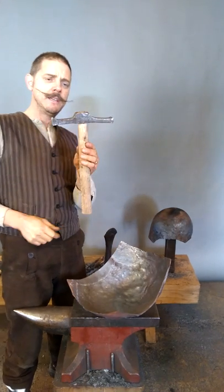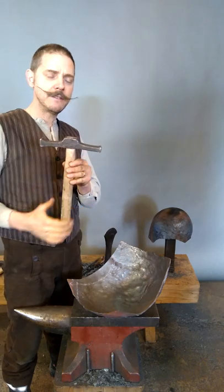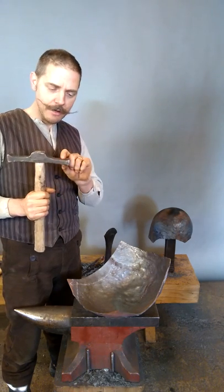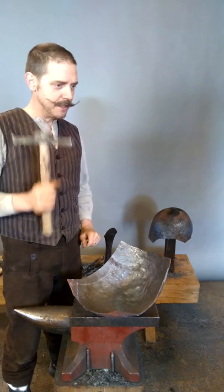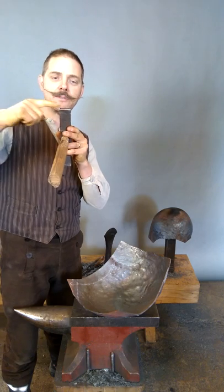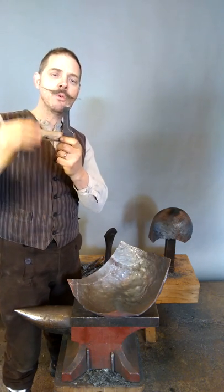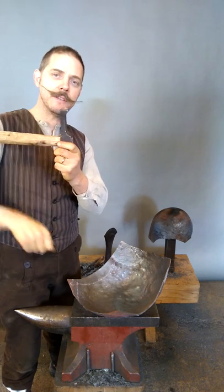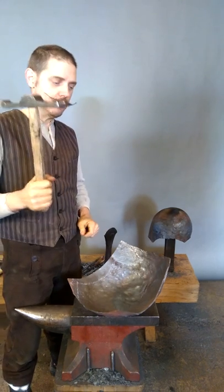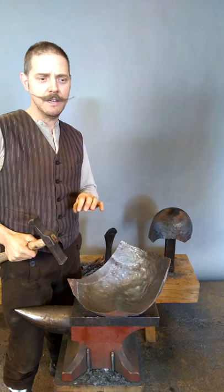The next hammer I've been using is this one, which you can also see in contemporary artwork — a quite common shape. Here you also have two heads. This one is a little bit lighter at 1.2 kilos, also made of 17th century iron with steel heads welded on. I use this in the start when I'm stretching out the material flat, because this head is more straight but more rounded here, so you stretch it more in one direction. I also have a bit more flat surface on this head, so if you have a lot of dents you can even the material out a bit. I use it when stretching flat on the flat anvil, and in the records from Arboga it's mentioned that the armorers have two stretching anvils.